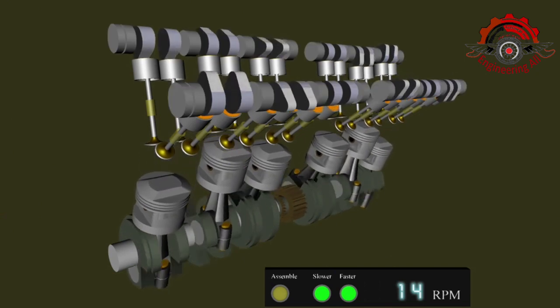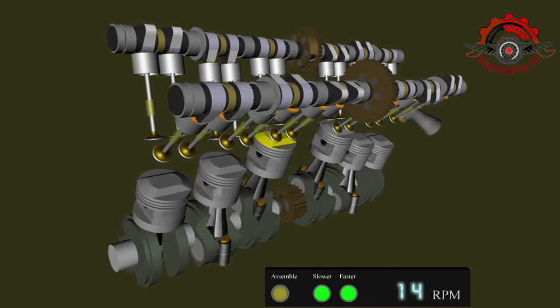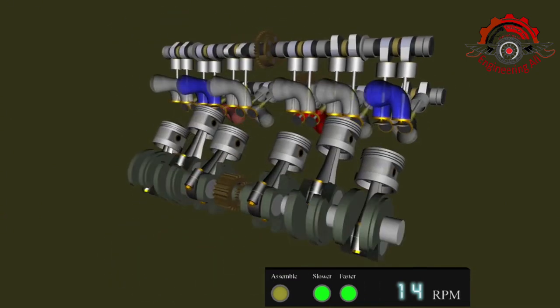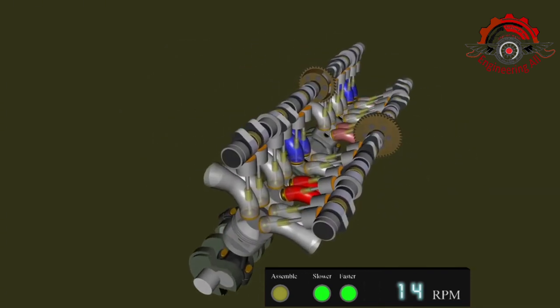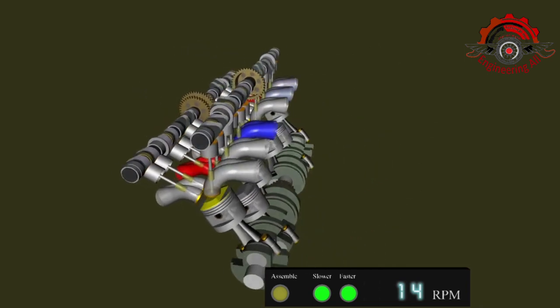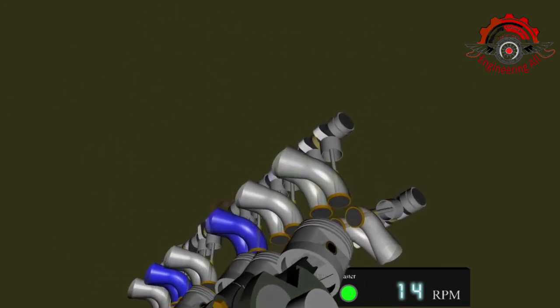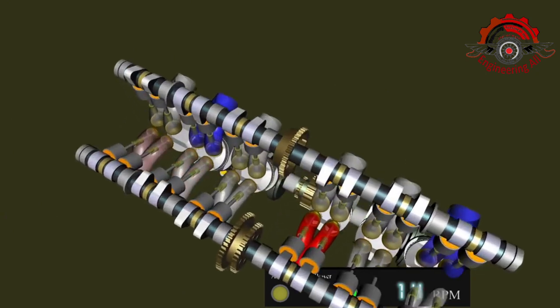Segment 6: Preparing the building. Preparation is the key to a successful insulation project. Start by cleaning your metal building thoroughly. Remove any dirt, dust, or debris that might interfere with the insulation process. Inspect the structure for any signs of damage, such as rust or holes. Repair these issues before proceeding with insulation to ensure the best results.